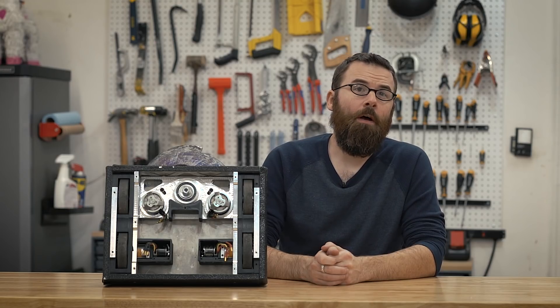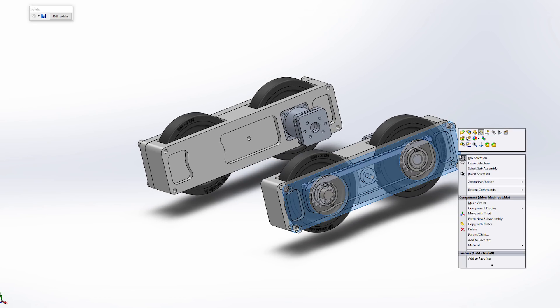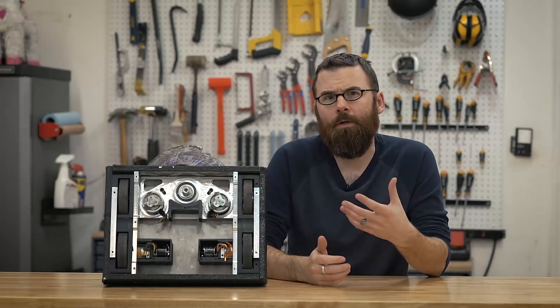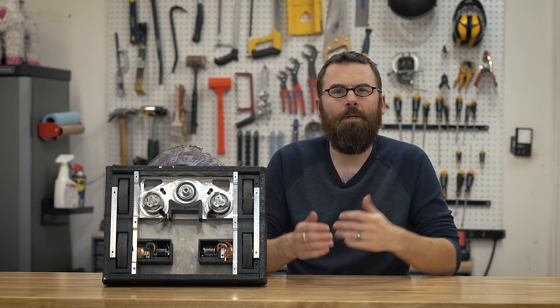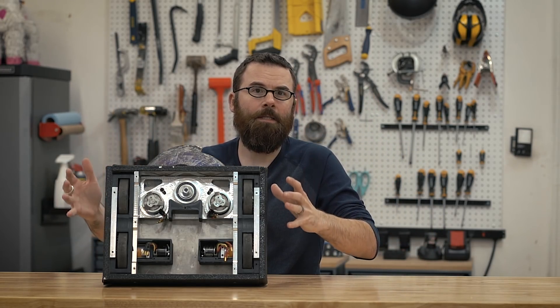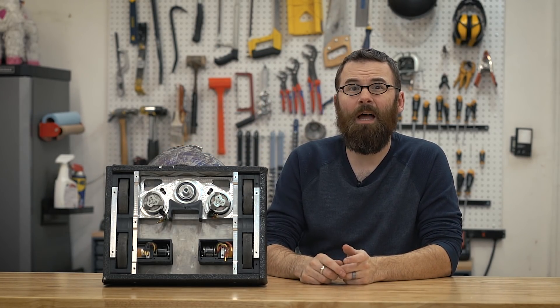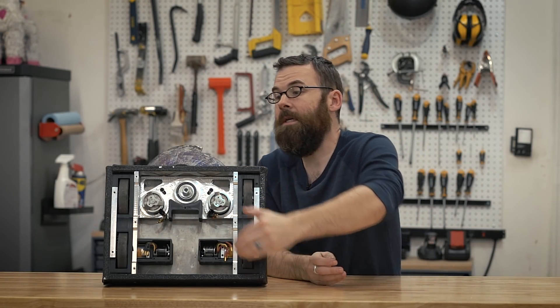As I mentioned in part one of this series, the drive system was the very first thing that I designed for this robot, and everything else kind of came later and was actually reliant on that. I started with designing these drive pods, testing them out, and ultimately I wanted to test out the motor, test out brushless drive, test out the firmware settings, and also test out the difference between a chain drive or a pulley driven system, and ultimately figure out what kind of speed I wanted and how much power I needed. Once that was figured out, the whole rest of the chassis and the design for the robot was built around that — so much so that the weapon disc was actually one of the last things I designed, and it was designed to fit directly in between the two front wheels after all the drive system and chassis was built. So really the core of this robot is these two drive pods.